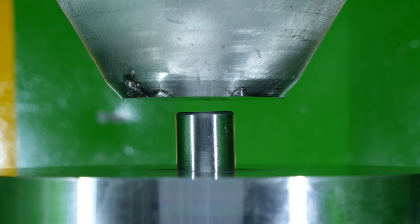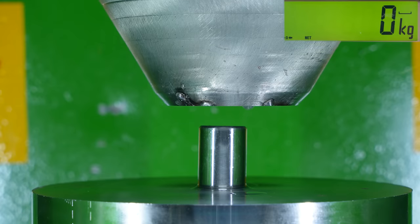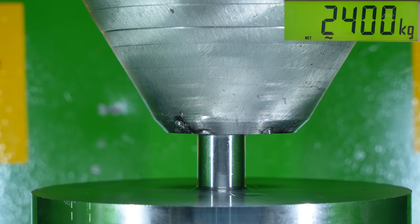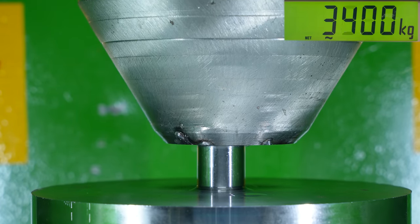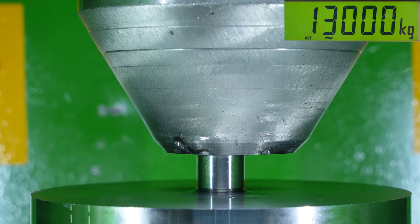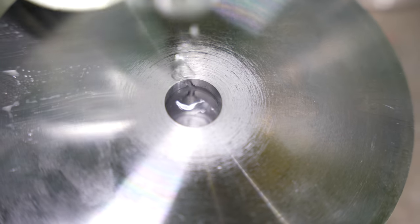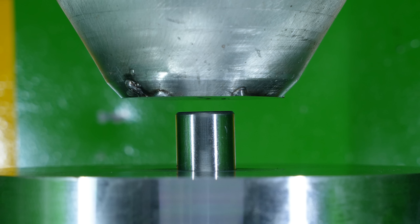Okay, now we have 0.15 millimeter squeeze there, so 3 times tighter. And I tested again. I had a small amount of distance left on the first test piece, and it took around 5 tons now. So we can still easily reach ice 7. And I also made this change that I leave a little bit of air on top of the water.